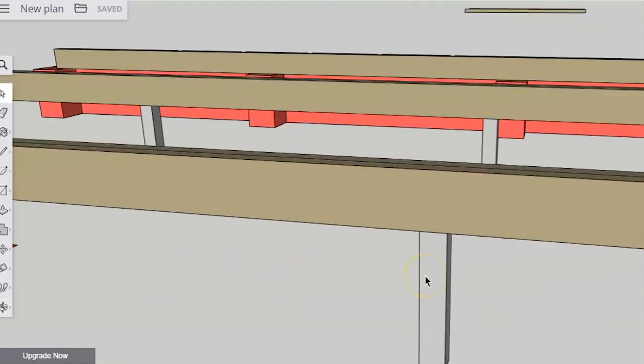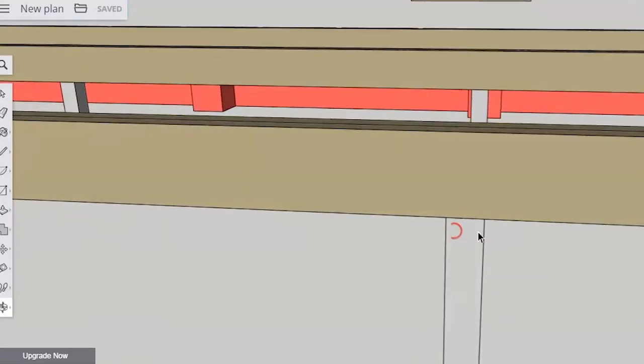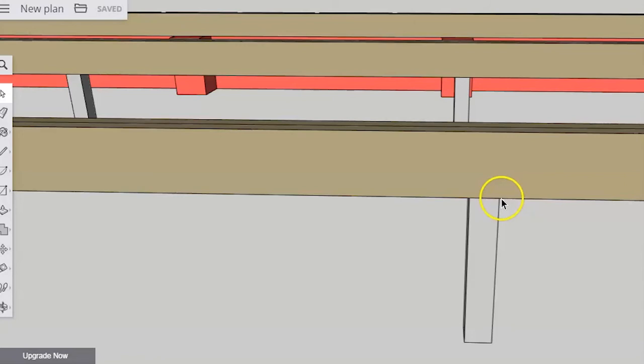You also have to make sure there is enough material for that bearer to sit on. If you have a 70mm post straight under a bearer, and this is a piece of softwood like a pine bearer with a heavy roof load on it, that would probably start crushing a little section of that bearer. Normally you would have a large metal plate across there to spread the load out. It's probably not a problem with a hardwood bearer, as hardwood is less likely to have the fibres crush over time, but you do have to make sure there is enough timber sitting on the post.